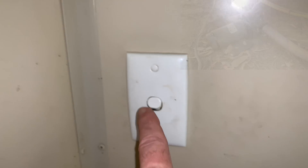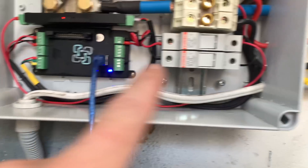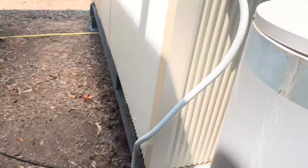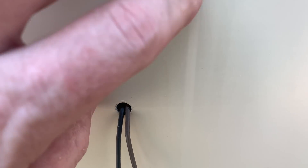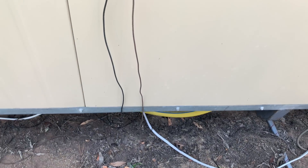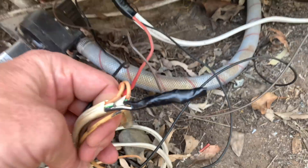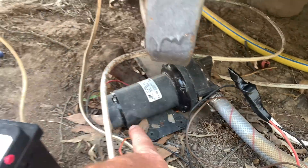We've got a switch in the shower so we can turn it on and off. We are not going to be wasting any water out here at the moment because we are on very limited supplies. We've got a second switch up in the kitchen sink so we can turn that on and off when we're doing the dishes. I disconnected the hot water system for now because I haven't got a solution that works for that, and I also forgot the conduit. So we've just got a piece of conduit laying there — this is only 12 volts so it's not a problem. These two little cables are going to get some tape around them, then that's 12 volt into the little switches inside the house and the USB ports. For now we've just soldered them up, taped them up, and we'll zip tie them underneath the house. But we've got power inside the house — we can decommission this now.